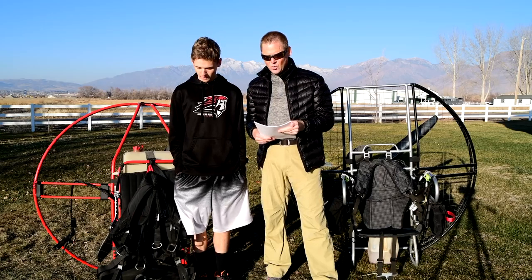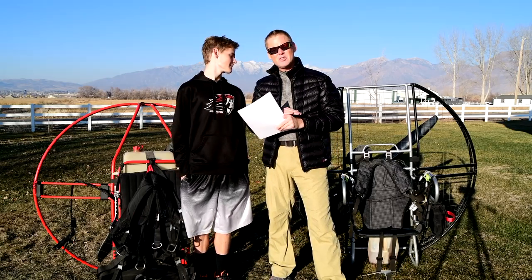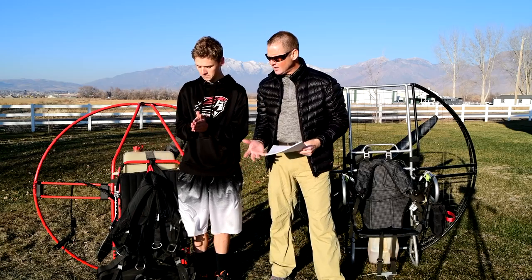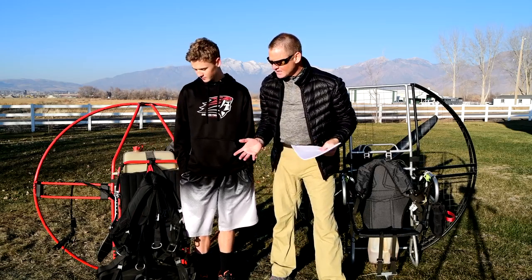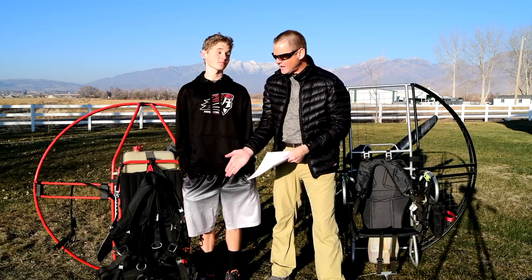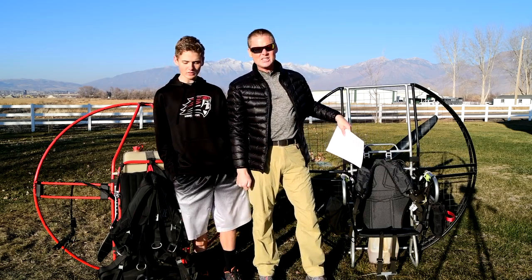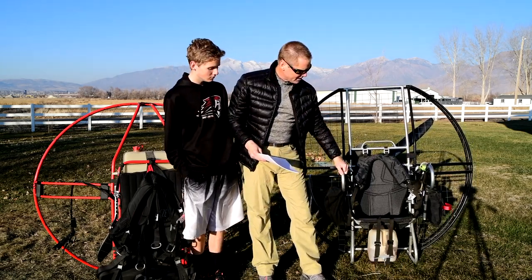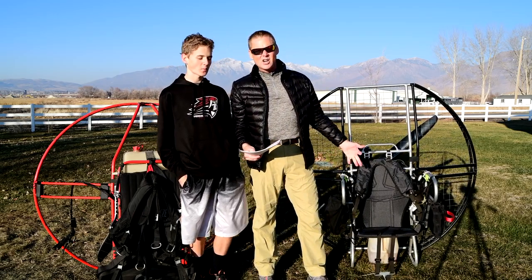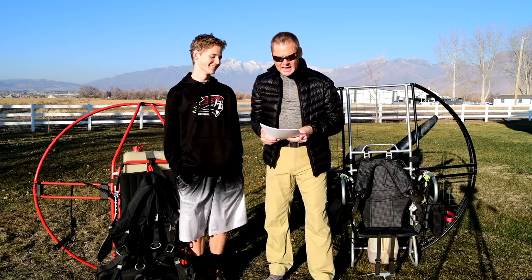Skids allow for hooking in without sitting in the mud. With units where your butt is the lowest part of the paramotor, you have no crumple zone — if you have nothing to protect your spine and you hit the ground, all that impact goes into your spine. And even simple things like when you're trying to hook in, you're literally sitting on the wet grass or the mud. With a flat top, you're sitting 16 to 18 inches off the ground, so you have a huge crumple zone when you're in flight — about 18 inches between your butt and the ground. Plus when you sit in it to get hooked in, you're not laying in the wet grass or mud, and since you're already 16 to 18 inches off the ground, it makes it a lot easier to stand up.